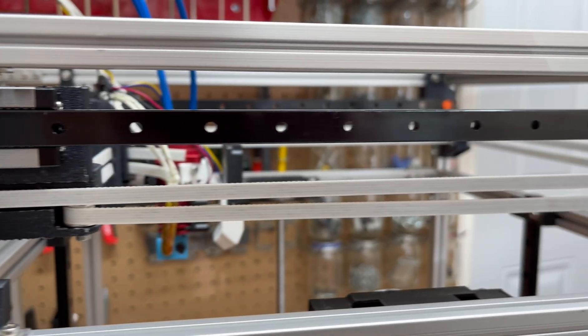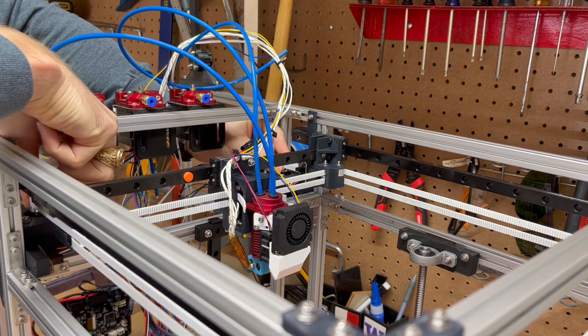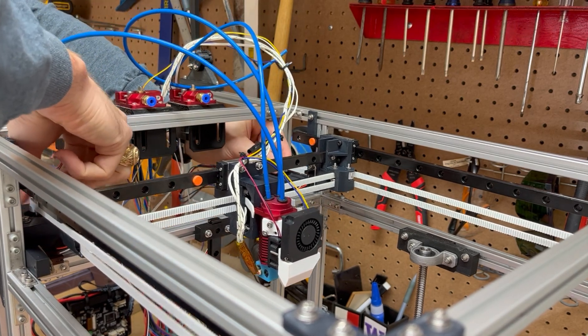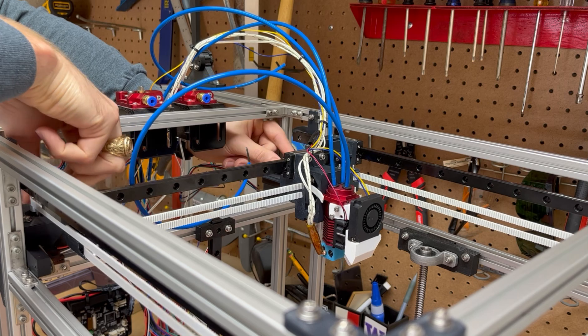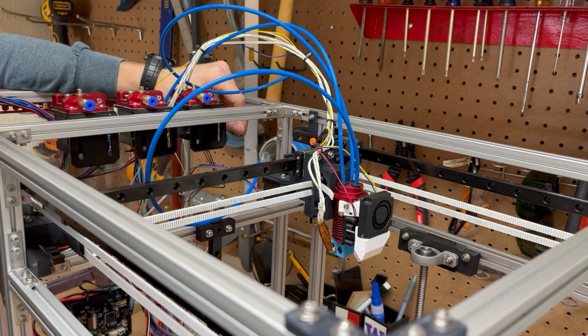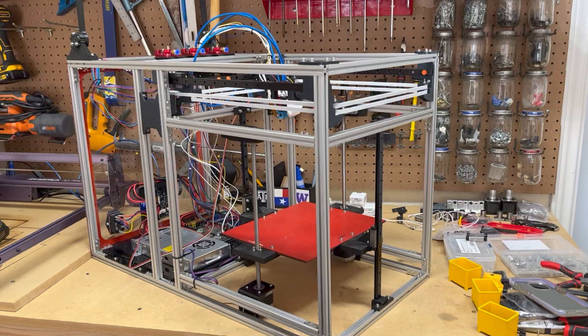The basic motion of Core XY is when both of the motors turn in the same direction, the extruder will move along the X direction. But when one motor is held in place while the other rotates, the extruder will move in a diagonal line. I can't test the motors yet because I still have to add the optical limit switches on this printer — I still need to add one on the Z-axis and fix the Y-axis. But when I tested the motion of the Core XY, the belts were not as tight as I had hoped for. There's gonna be a redesign of a redesign, isn't there? I think I can fix this by reprinting a belt clip which the belt can in turn tie to.